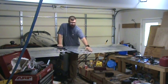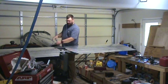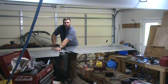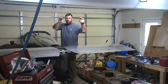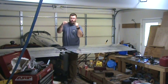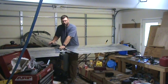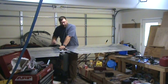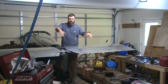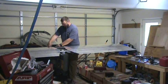Basically, it was get this one at 35 degrees down, and then open up this cable and adjust where it screws into the cover plate and the brace here, and actually slide the cable shell forward to allow this one to move far enough down, because the interior part of the cable was hitting the exterior part of the cable. So we had to shift the exterior part of the cable several threads despite following the directions exactly. Otherwise, this side wouldn't go down far enough. And then from there, once it was down fully, it naturally lined up with the edge here at level.